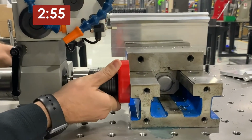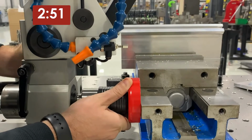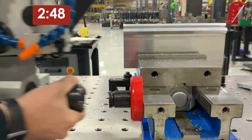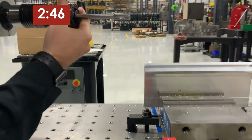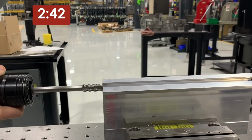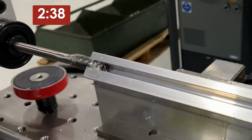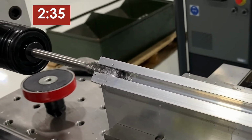I told them to send some parts in and we could run a tap test on the FlexArm. The extrusion needs 2 inches of total thread depth and needs to accept a set screw in the end, so we fixtured the part horizontally and decided to go with the GHM18 hydraulic unit. This has the multi-positional head which will allow the operator to tap horizontally and easily reach their desired thread depth.